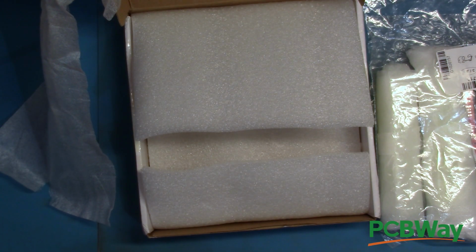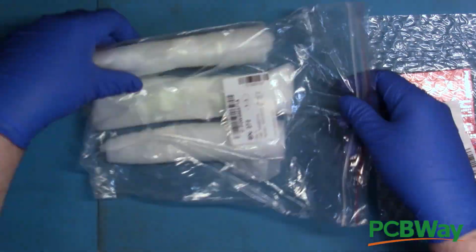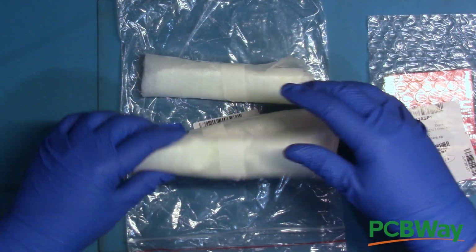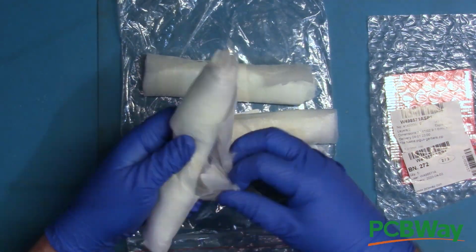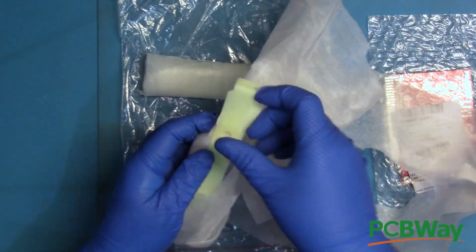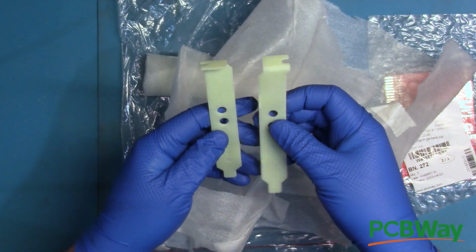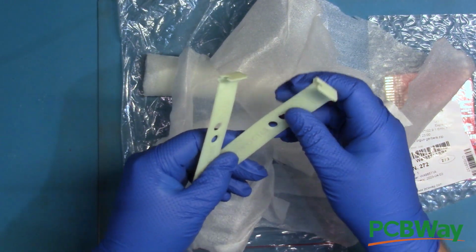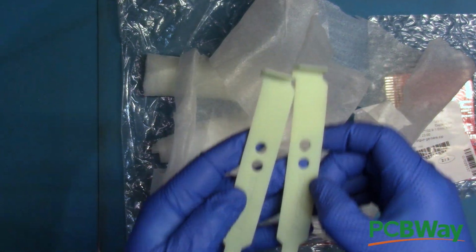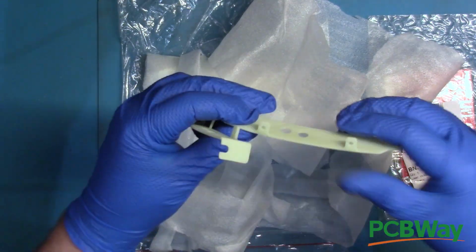I had 5 of the PicoGUS brackets printed in UTR 8220 resin. This resin seemed to be a good fit, as the description of this material stated that UTR 8220 printed parts have high precision and good dimensional stability. It is suitable for functional testing and product processing with higher requirements for toughness. Excellent temperature resistance, can maintain the strength, toughness, and dimensional stability of the product at 65 degrees C.